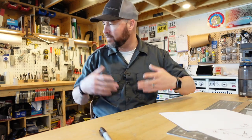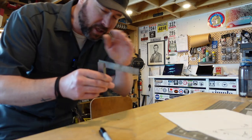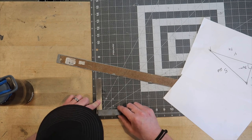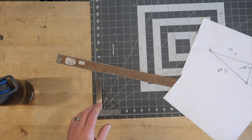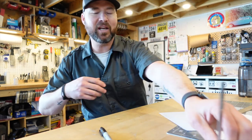This is a super handy trick for larger construction projects. Obviously when I'm working in my shop, I'm not doing the 3-4-5 all the time — if I've got a little part, I'm using a square. But for a lot of work, even sheet goods and lumber, a square is easier. When you get into larger projects like long beams, a fence line, or laying out the foundation of a house, this is accurate enough to use.